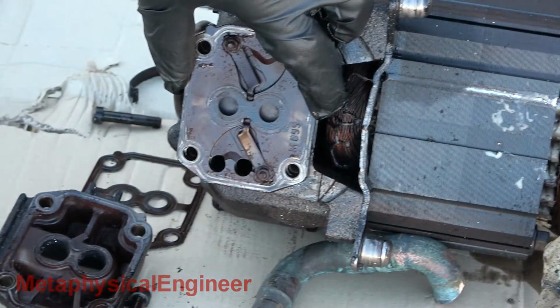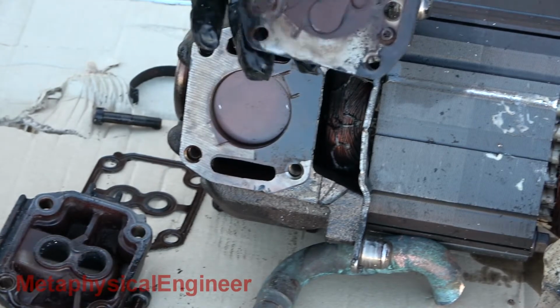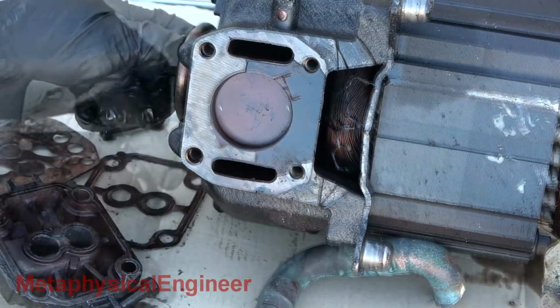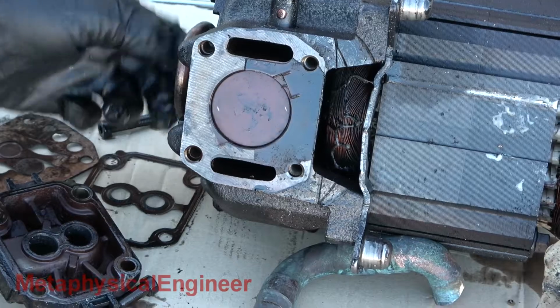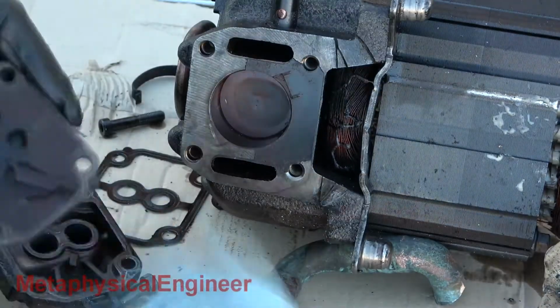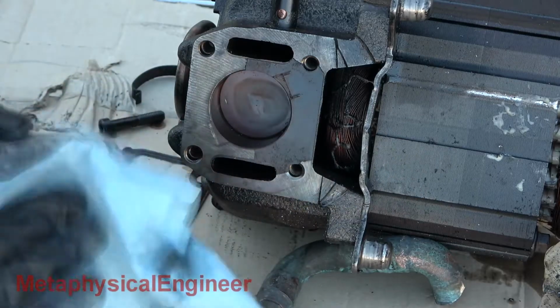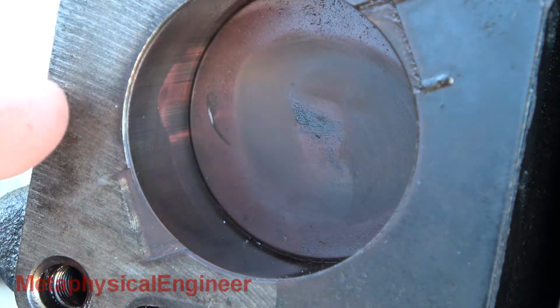Apologies for the shake, a big rig jiggled the camera. The second gasket was intact, but had gotten so hot that it cracked when I pried the valve plate off. The compressor was still running when it was taken out of service, and it turns freely by hand. Given these bits a quick wipe, prolonged heat and broken down oil has discolored everything. Definitely some copper plating and scuffs on the cylinder wall from lack of lubrication.